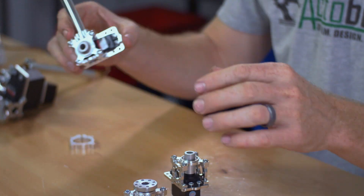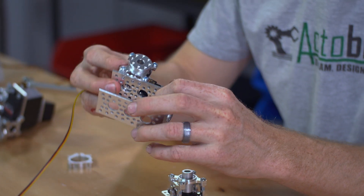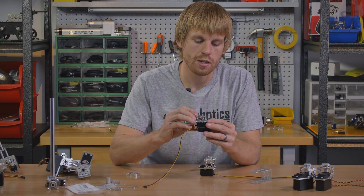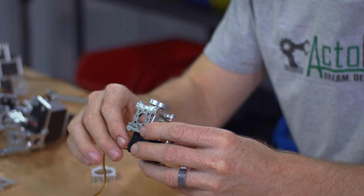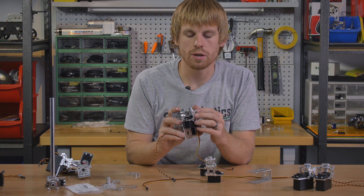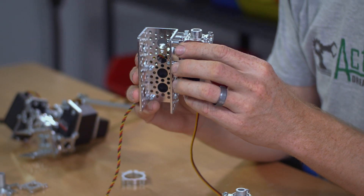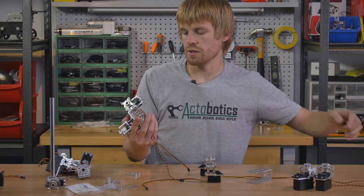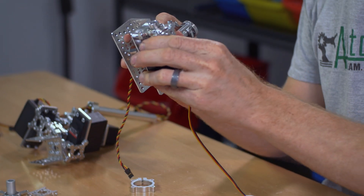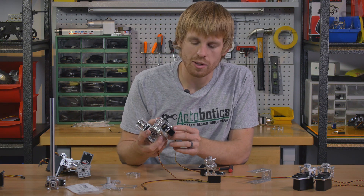You can lay this servo block over on a piece of channel if you just want it laying down flat, and then use the 770 pattern on the outside. Another way you can do this for indexing — and I do this quite often — you can put a hub spacer on the outside. I've bolted a hub spacer on the very outside of this servo block and then I've put a 1 inch clamping hub on the side of the channel. So if you want to re-index this, you can loosen the pinch bolt on the clamping hub and rotate this around however you want. When you get it in the right position, you just lock it back in place.